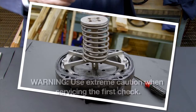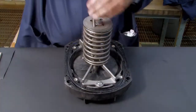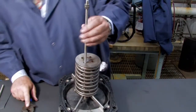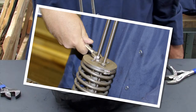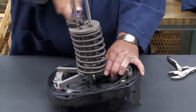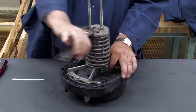To access the seat and clapper rubber ring of the number 1 check, place the check on a flat surface with the coil spring facing up. The spring surrounding the clapper shaft must be compressed. Place all-thread rods through the two holes in the spring retaining plate and thread the rods into the hole at the base of the spider, tightening with two nuts. To compress the spring, loosen the top nut and back it off without unthreading the rod from the spider, then tighten the nut closest to the spring retaining plate. Tighten both nuts evenly to ensure safe, level compression. During compression, the clapper will slowly move up away from the seat. Compress the spring until the clapper has moved approximately 1 inch from the seat, allowing you to clean and inspect the seat for damage or debris. With the inspection complete, slowly back the nuts off to release the compression and unthread the rods.